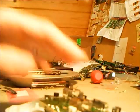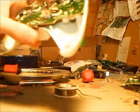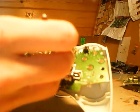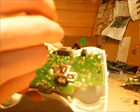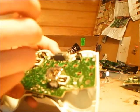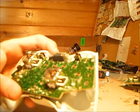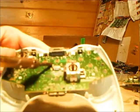I'm going to be doing the other LEDs really quick to show you. Another way you can tell if you're putting the LED on right — to know which side is positive or negative — you can get an LED and once you take the other LED off, just grab your tweezers and hook it up there. Make sure you have the guide I gave you to let you know which side is negative or positive for the LED and the board, line it up, and it should light up. If it doesn't, you might have to adjust a little bit. If that still doesn't work, simply smooth out the pad. Take the battery pack out when you're soldering so you don't have a chance of wrecking it.